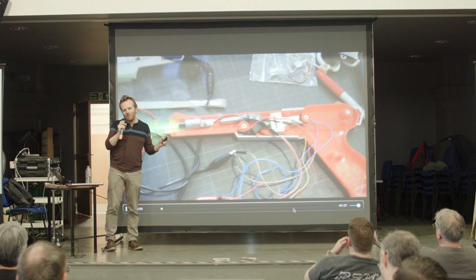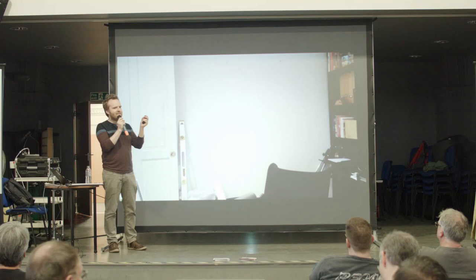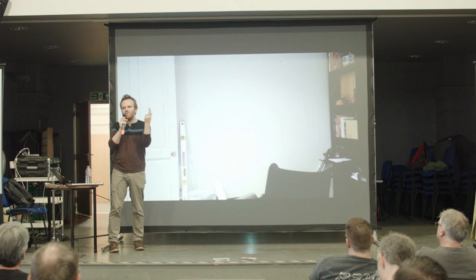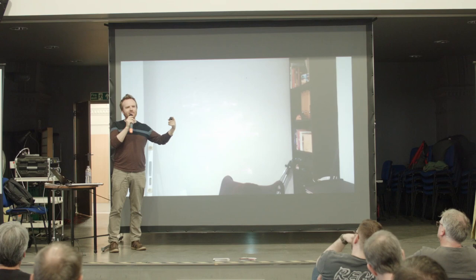It's pretty fun, but yeah, I talked loads about that yesterday, so I'm not going to today. But instead, I'm going to talk a bit more in detail about how I work with lasers. These are scanning lasers with galvanometers. So there are two mirrors attached to galvanometers. Galvanometers are the things in VU needles, you know, the meter things. And they're essentially like a coil that moves a needle in response to electricity. So two mirrors, one which rotates one way and moves the laser up and down, and the other one rotates another way and moves the laser left and right.